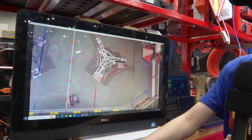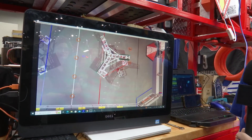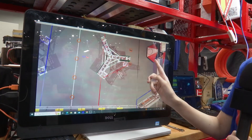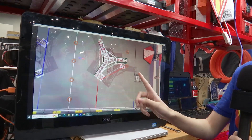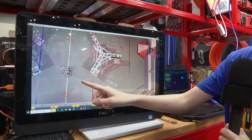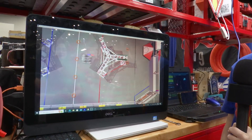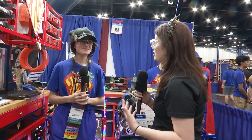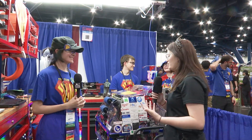And here is our bypass: if a note is missing it will bypass to the next one and keep going. Since we have modular auto paths for each note, we know exactly where to go, especially depending on which side, because we know teams are running on their stage side too. So when we bypass we'll always run around and not under the stage. It really feels like a lot of your programming is an effort to make the driver's life a lot easier.